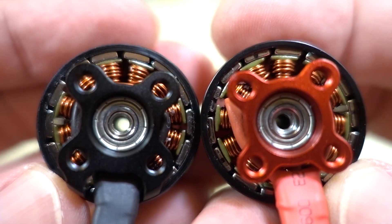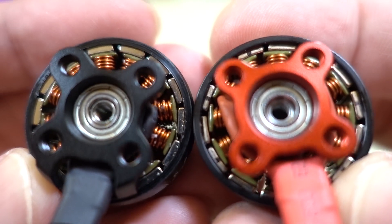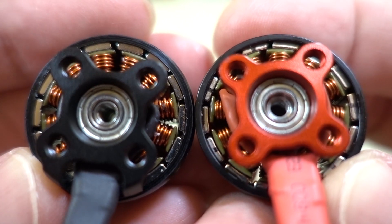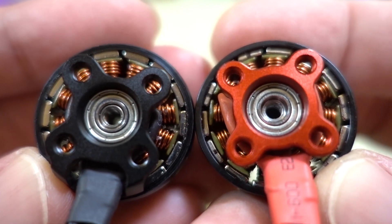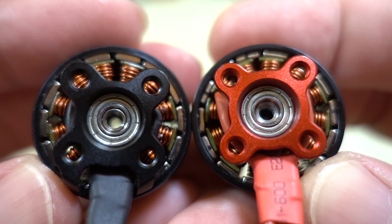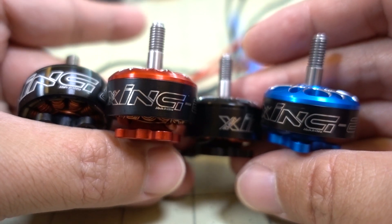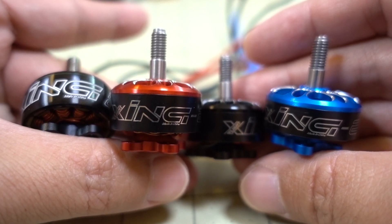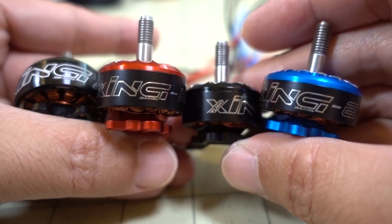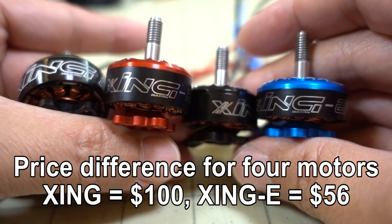Got the bells back on and comparing the air gap. It does seem to indicate that the magnets have a little bit more of a gap, being that the bell is a little bit thinner — a little more of an air gap. So it could possibly lead to a little bit less performance on the top end. Honestly, to me they felt pretty similar, and I couldn't really tell that much of a difference. I just wanted to get this video out to show you the differences between the Zing E and the Zing motor, and you guys can make your own decision. To me, it's not much of a difference, so I think the Zing E is definitely going to be worth going for.